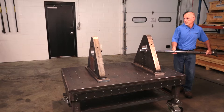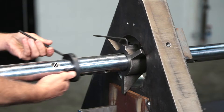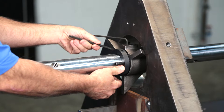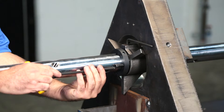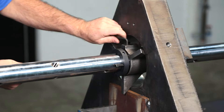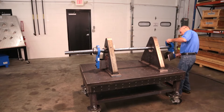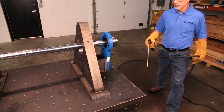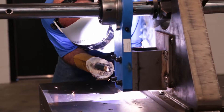Slide the bar through the holes to be bored and roughly center it with the setup cones. The setup cones are forced into the bore with the clamp ring jacking screw and locked onto the bar. Slide on the spherical bearing mounts with the tack weld plates and tack weld them to the workpiece. Patented spherical bearing mounts can be mounted up to 5 degrees out of perpendicular alignment.